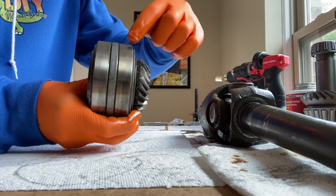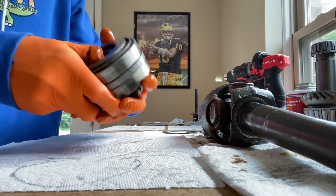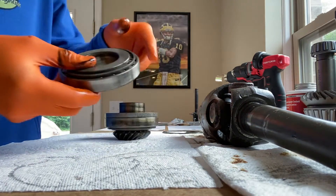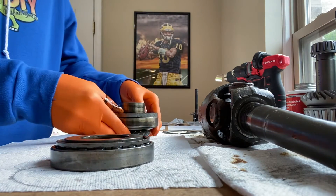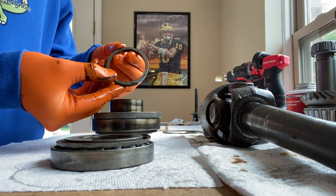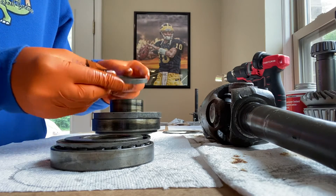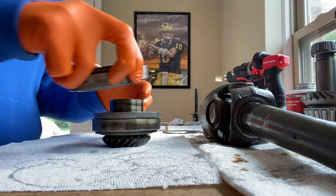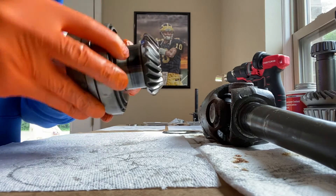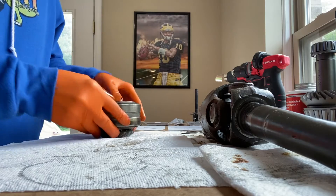Changing camera angles — here is the gear, the outer carrier and bearing, and in between the two carriers is a large spacer. Removing the inner bearing and setting it to the side — it looks like a normal bearing. However, look what's inside: an actual small spacer. That is what we were just talking about on the computer. This is the original design with the slip fit bearing set. In the event you are servicing your original slip fit unit to replace the oil seal, this small ring has to be inside the bearing set when you reassemble and set your preload. And you can see how easily the bearing slides on and off the gear.